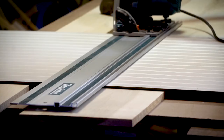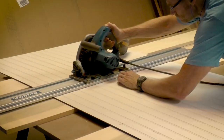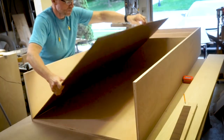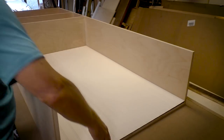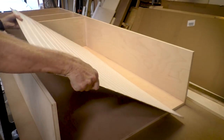I finally broke down and bought a track saw midway through the project — I kind of wish I'd bought it right at the start. The reason I bought it is because this bead board has to be cut very precisely; it has to be exactly the right size to fit inside the cabinet. Because this is going to be painted, I probably could have caulked it to mask any issues, but I really wanted to get it right and it fits really well.